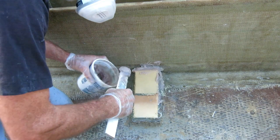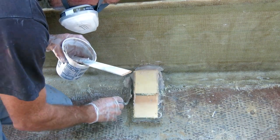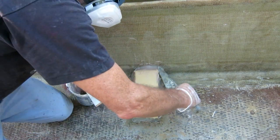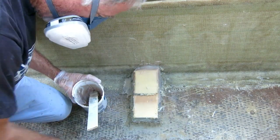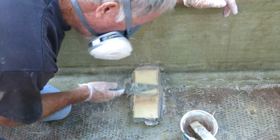I mixed up a lot of thickened resin and I'm smoothing all these curves out on the little pads to give the glass a decent chance of not having a bunch of air under it - just smoothing everything out and making all the corners rounded.